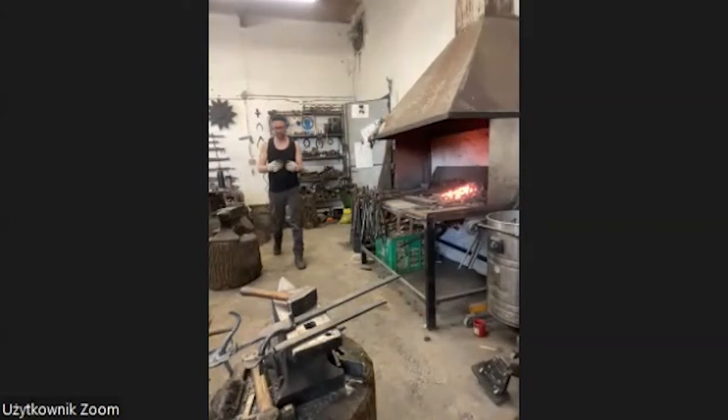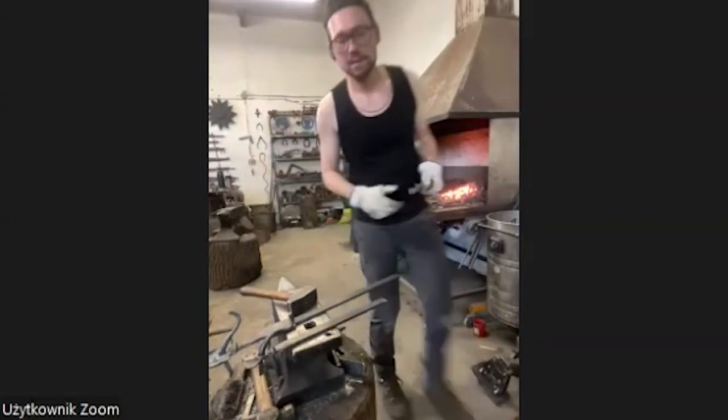It is not embossing, it's upsetting. Upsetting, yes. It's possible, yes. Yes, of course. For example, I made a first try out of, I don't even know what this is, 20 to 16 or something like this. And I upset it to 40 to 8, you know. It was a lot of work. Of course, you can do it like this.